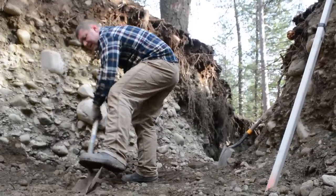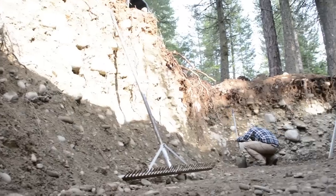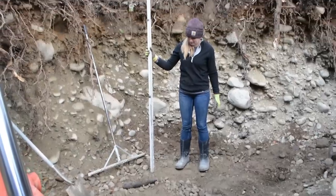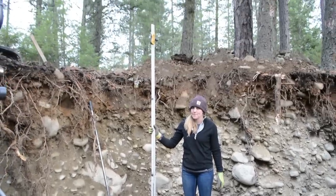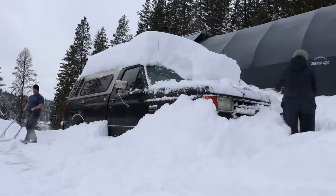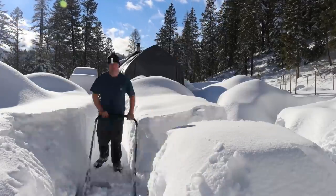One of the big drivers of getting this work done as soon as possible, at least the footing, is that back retaining wall. The soil is actually really stable here. A lot of people watched our water system video and they had a lot of freak out moments because of the height of this wall and the aggregate and everything. And I'm not saying that this wall couldn't collapse, but the septic or the cistern hole was an exception because we had 4 feet of snow and 6 inches of rain on top of that snow, which is what made that thing somewhat unstable. Otherwise, it was very stable.